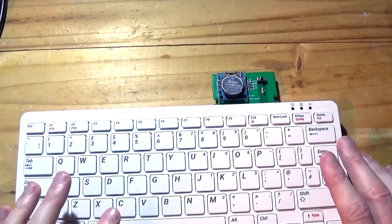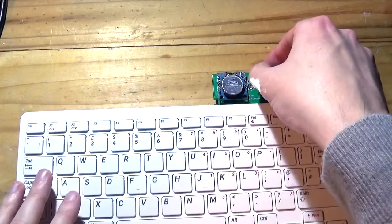While the OS is actually running, you can flick the switch, it won't make any difference, and it's when you power cycle the machine again, it will then on a reboot detect where the switch is and if it's pulling A or B low, and then it'll make the switch to boot the OS accordingly. Okay, there we go. So hopefully you're now up to speed on how this works.